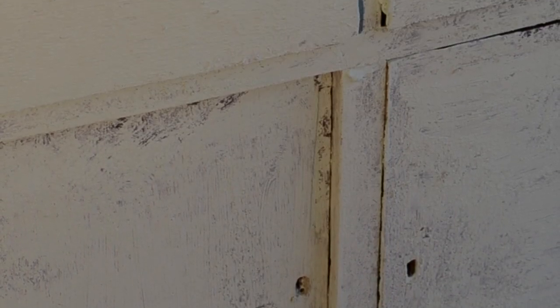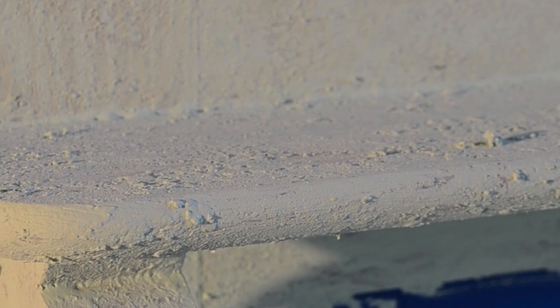This step helps to provide the weathered, layered, textured look, so you want to retain some of the non-uniform coating of the base application. If the Salt Wash layer has become too dry to smooth down the peaks, simply add a little water to your brush and easily re-smooth. And you can always reapply more of the Salt Wash base coat to add more texture.